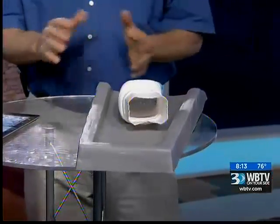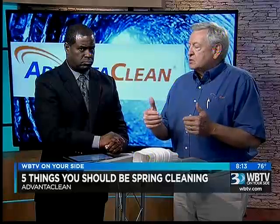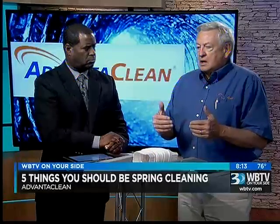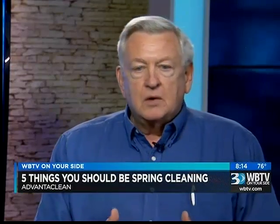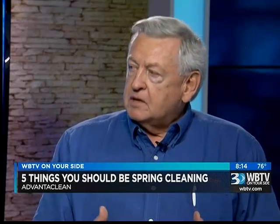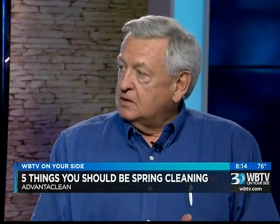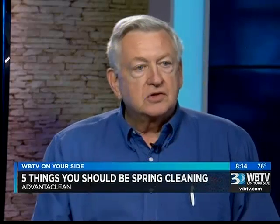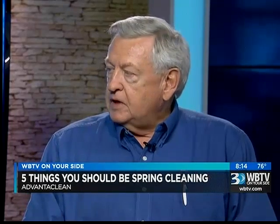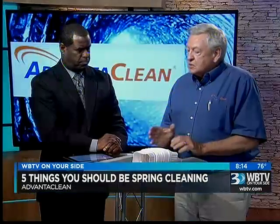Okay. Before everybody's out putting mulch in and planting flowers, one of the things you want to do is scrape the mulch or the pine straw away from the foundation and make sure that the ground itself hasn't settled down at the foundation. That happens over time. When a house is built, they backfill along the foundation, but it's not really compacted. So the ground settles. You put layer after layer of mulch or pine straw in there, and it looks like it's level. In reality, it's settled, and now the water is sloping right back towards your foundation. So you really want to rake that away, add a little dirt if it's low, and build it up so that the water, once it gets through the mulch onto the ground, flows away from the house.